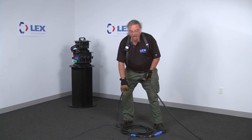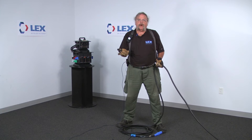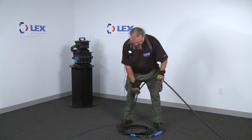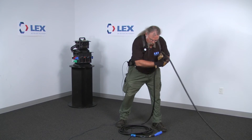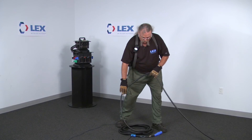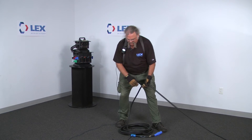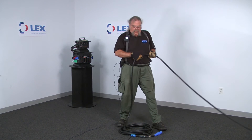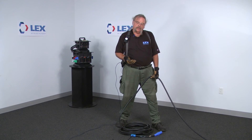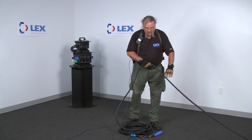We have to put the twists into it, but you can use your entire frame and both arms to pull. For our feeder cable, it's about a pound per foot — roughly 0.98 pounds per foot — so this is going to be a hundred-pound roll of cable. Get the pole with both hands and get it to twist as you lay it into the coil, using your back, your legs, and your arms. This way you can use both hands to twist the cable after you get the length to you, rather than just your arms, because your arms will get tired after the first 50 feet.